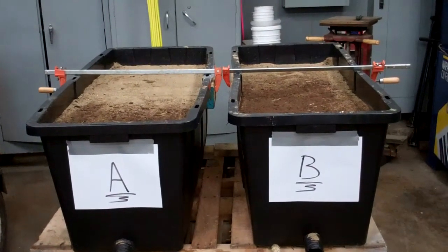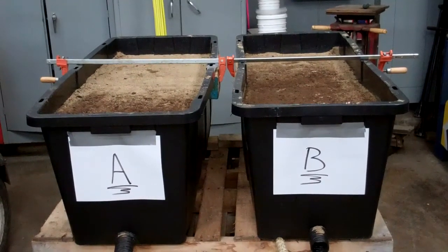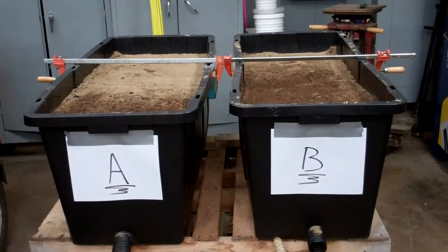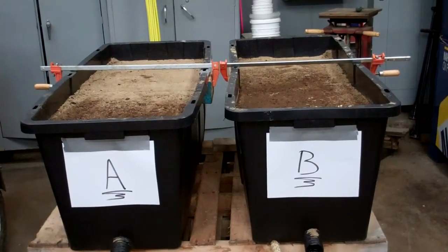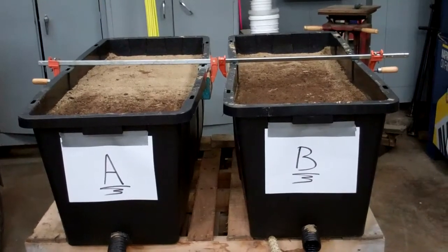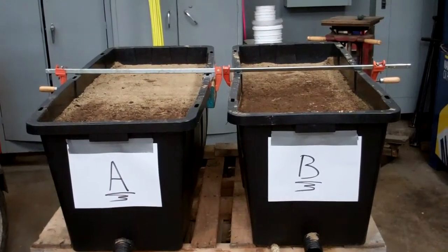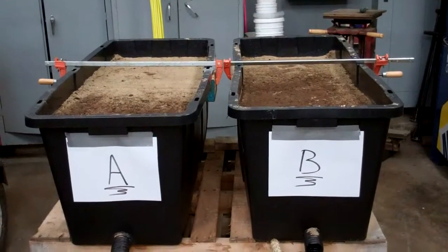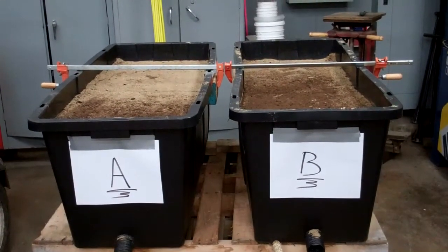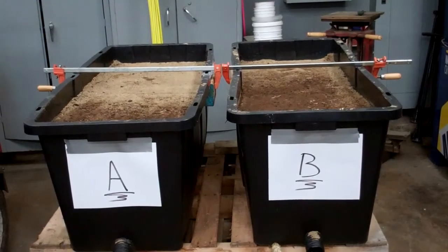The challenge is if it doesn't flush frequently enough, that bottom area there that stays wet and saturated turns anaerobic and can become problematic — not only with poor biology, but with iron precipitating out and sealing up that zone, impeding drainage. So if you get frequent enough rain events, the flushing occurs and things are fine.